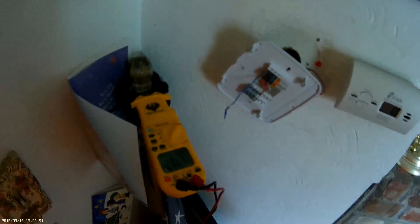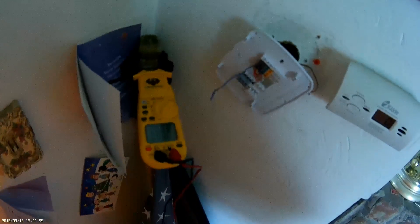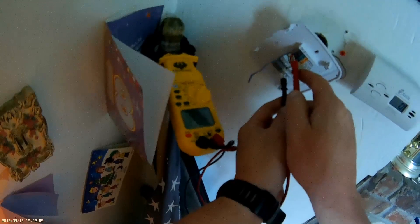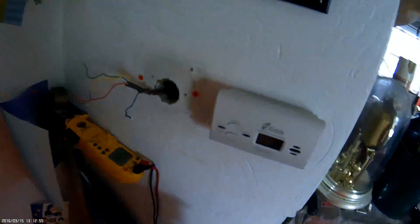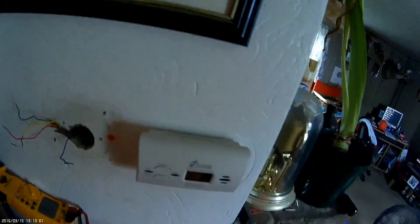There's no common on that control board on that old unit. Let me make sure I'm getting 24 volts to my red. Open circuit — 27.75. I'm going to strip this blue wire back a little bit, just like that.